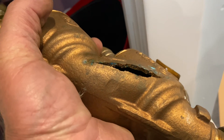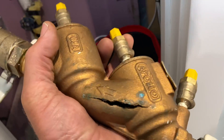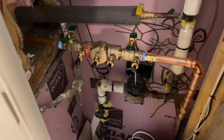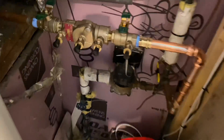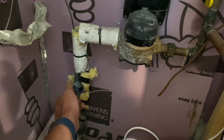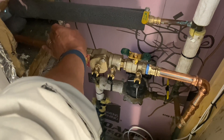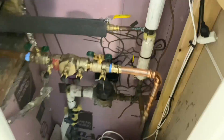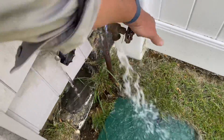Imagine the kind of pressure needed to crack it open like that — damn. This thing is heavy too. I don't want to drop it and crack the tile. Okay, let's close that and restore water service. Valve one and valve two. Let's open this and flush from there — we have the two drains open outside. Everything is flushed out, so let's close the frost-free and close that drain. Perfect.